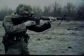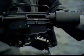Remember, the XM16E1 is a gas-operated, air-cooled, shoulder-fired weapon capable of semi-automatic or automatic fire. It fires 5.56-millimeter ammunition fed from a 20-round magazine. The weight of the loaded aluminum magazine is seven-tenths of a pound. The weight of the loaded weapon is 7.6 pounds. Its maximum effective range is 460 meters. The in-line construction helps to assure accuracy of fire by reducing muzzle climb.